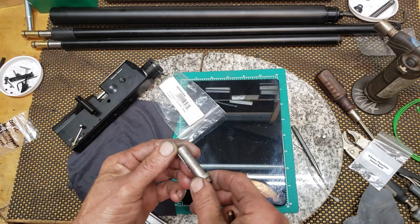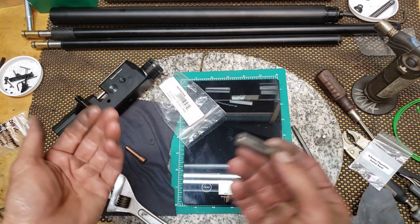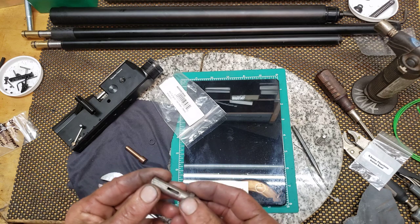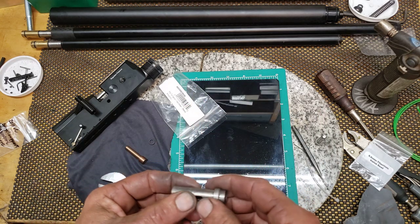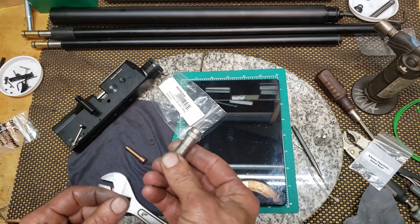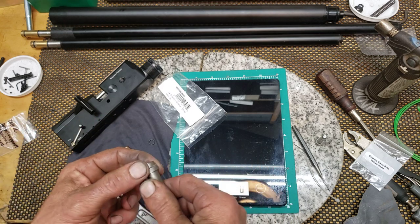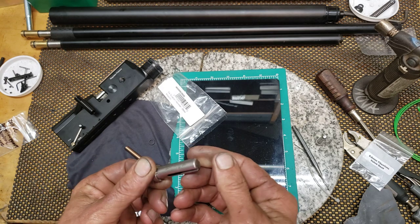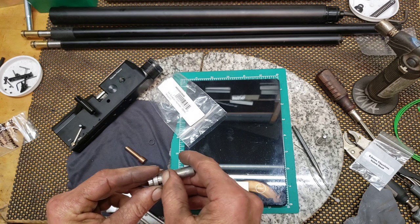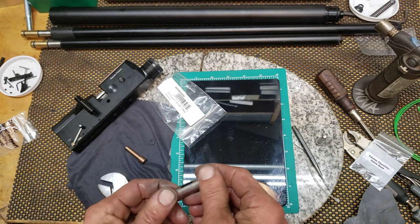I would just clean up inside, give it a nice polish. Personally, I'm going with the dry lube. I need to take this apart more often — I didn't even realize it was this bad. I got caught in the rain, wiped it down, even took my air gun and blew it out, but as you can see that's not always good enough. I think a good spray of silicone inside — not excessive, just enough — will really help repel the water and moisture. That way I'll have a little more security.